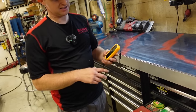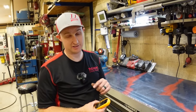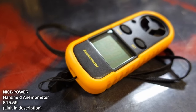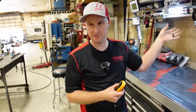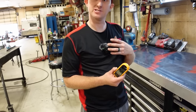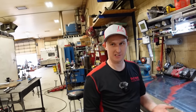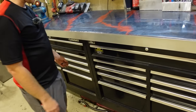He also has a tool that measures airflow and air temperature. It's primarily for airflow measurement but he uses it to measure wind temperature when testing AC units or furnaces. Unlike laser thermometers that test surface temperature, this gives you the actual air temperature as it blows through the vent — very useful for working on furnaces and air conditioners to confirm they're working properly.